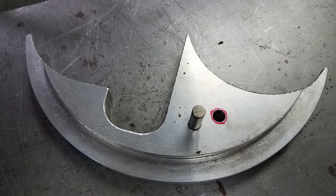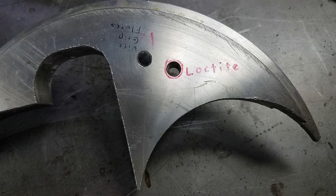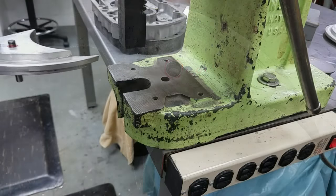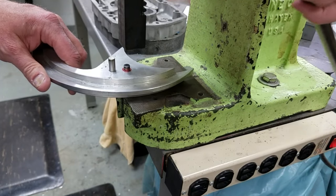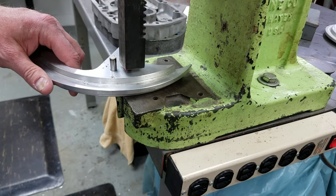This gave me a very light press fit as I expected, so I used Loctite Red to secure the pin in the hole. I let it dry for two days, then took it over to the arbor press to confirm that the pin could be readily pressed out if it ever needed to be in the future. It pressed out easily, so this is a sound method for securing the pin into the bearing plates.